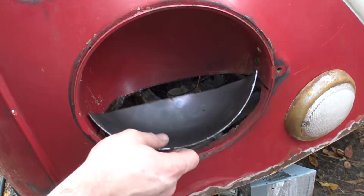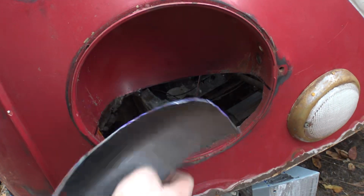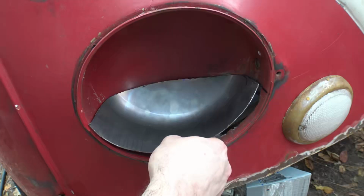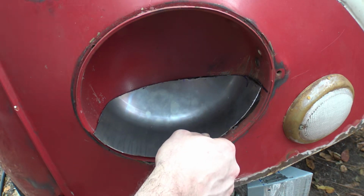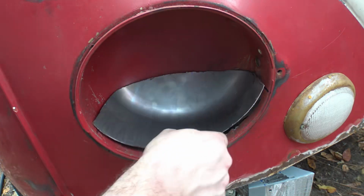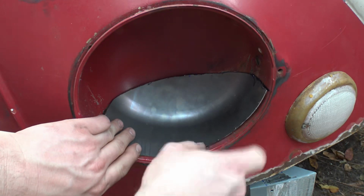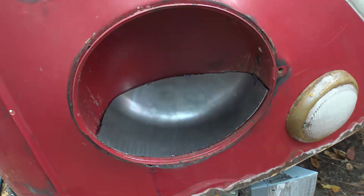Well, I think what I'm gonna do, scratch off some of the paint on the inside of the factory bucket up in here, and I'll start tacking this thing into place after I deburr it. I still have all these little ball catchers on here. Get all of those sanded off, get this thing tacked into place, and then wherever it lays here in the front, I'll then run the saw either right along this edge or through both pieces at the same time and tack it in as I go. But we have a bucket. There it is.